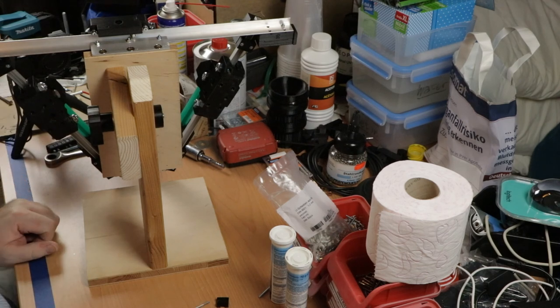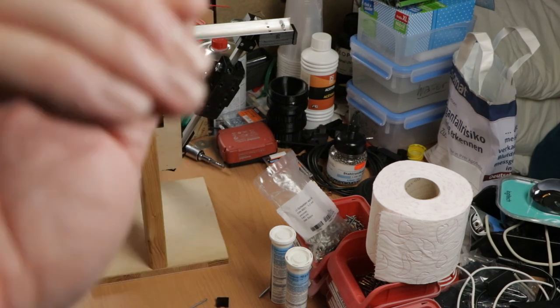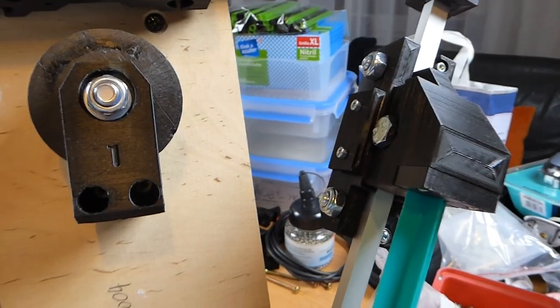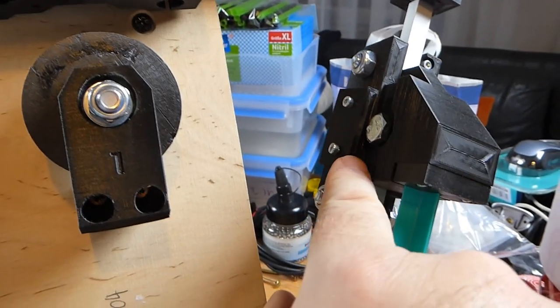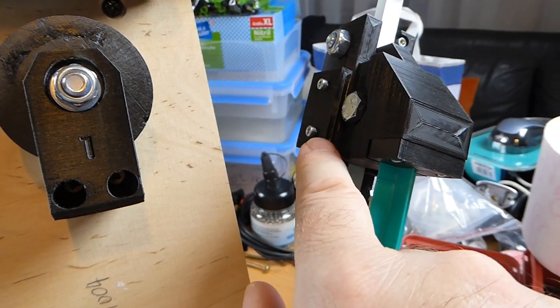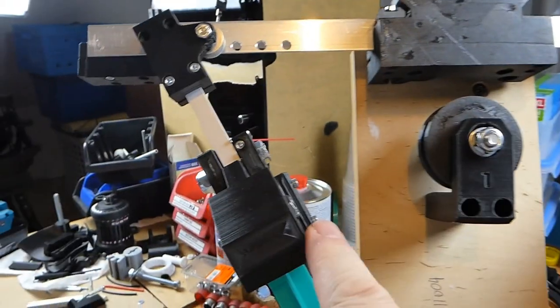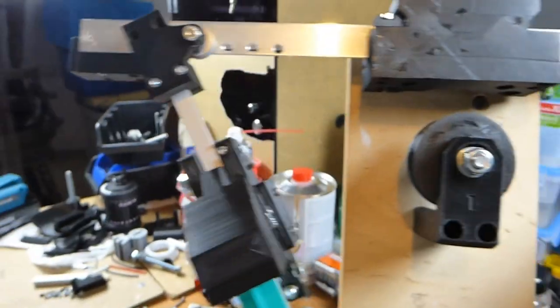So this is tedious. I'll be back in a minute. I was reading my drawing right, but the drawing itself was wrong. This small clamping plate to clamp down the timing belt actually was on the other side. So I had that wrong, and on that side as well. I corrected my drawing already.